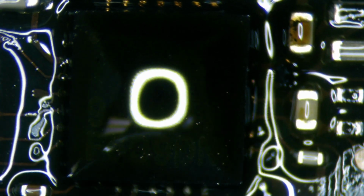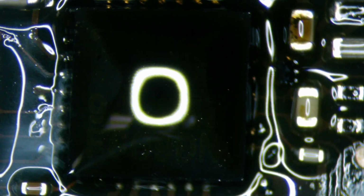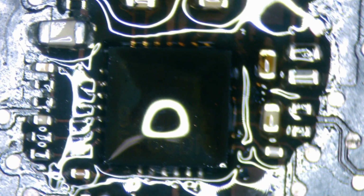And then you take a look under the microscope. You can look at each side and make sure it's perfect, because there are a lot of points here going to a lot of different places. And again, this covers many areas on the board, as you saw in the board view there. So it's really, really important. We see all the points there. Everything looks to be pretty good. Touched it up well. It looks very even.